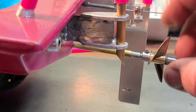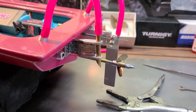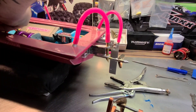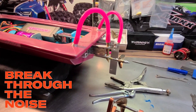Now we have our drive dog and propeller on, we can put the nut on — this is what holds it all in place. If the propeller is rubbing on the stuffing tube it's going to make heat and can break your prop shaft in half, so make sure it's not rubbing. Let's get the battery hooked up and see what this thing will do. I'm going to run it with a 2S battery for right now — I don't like putting big power on it when it's not in the water.